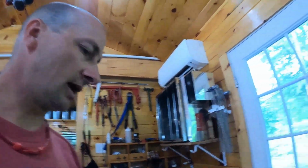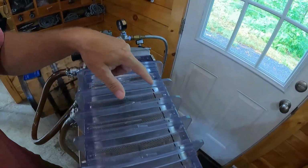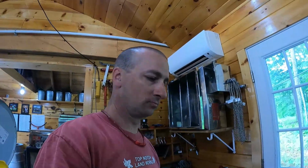But it's not easy. So what I did, again, you take advice from other sugar makers, is we put a line on it. So on top, there's a Sharpie line that goes all the way over so that from the top I can look, and if there's one dot of Sharpie that's out, then I know my press is set up wrong. This way, I haven't had trouble because when a press is locked up, it's nothing but a mess.